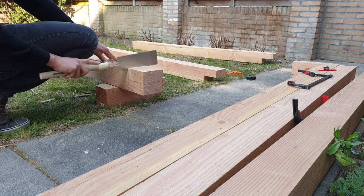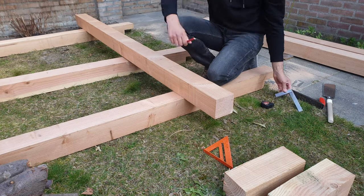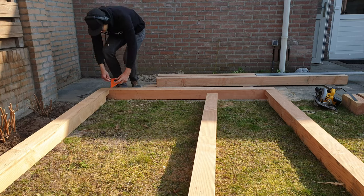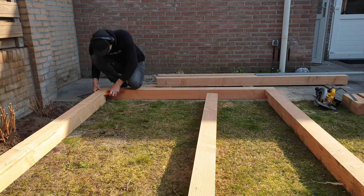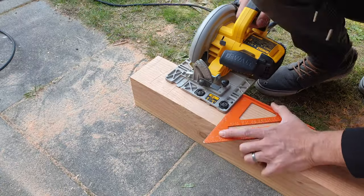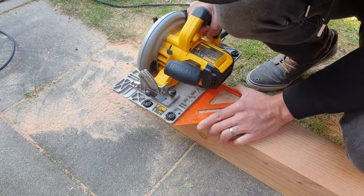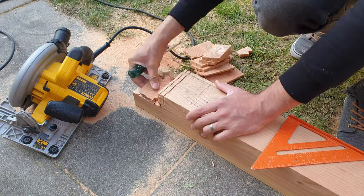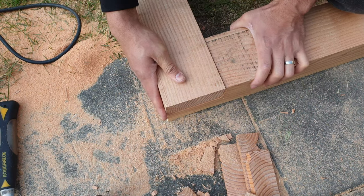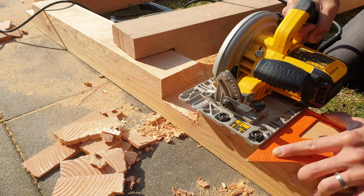Plus it's super sturdy once it's finished and I like that as well. Next I use the posts to mark out the corresponding cut out that is required in the top beam and cut those. Since these are shallow cuts I decided to use my circular saw for those since I could reach the right depth in one pass. Once all the cuts are made I clean it up with the rasp and dry fit the pieces. A useful tip for this cut is to use the piece you already cut to set the depth of your blade. This way the corresponding piece is exactly the depth you need.